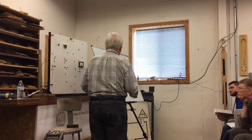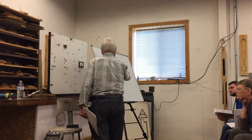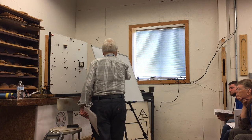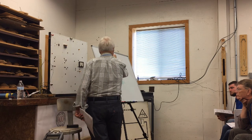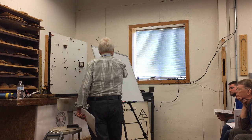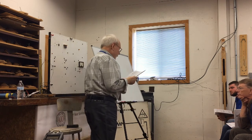At the next moment in time, instead of this being plus, this is plus. So we need to get from here to here. We put a diode here. It goes through the contraption. Needs to get up to here, so we put another diode here. Okay. It's called a bridge rectifier.